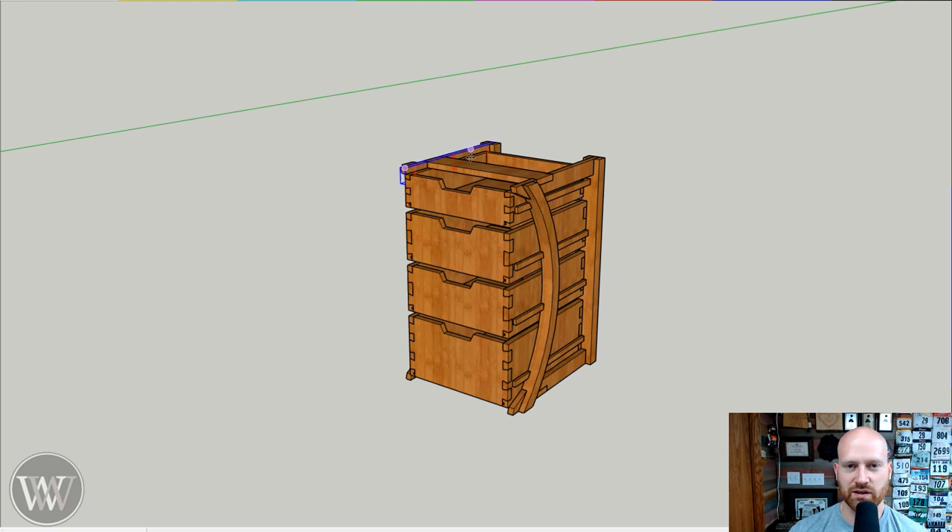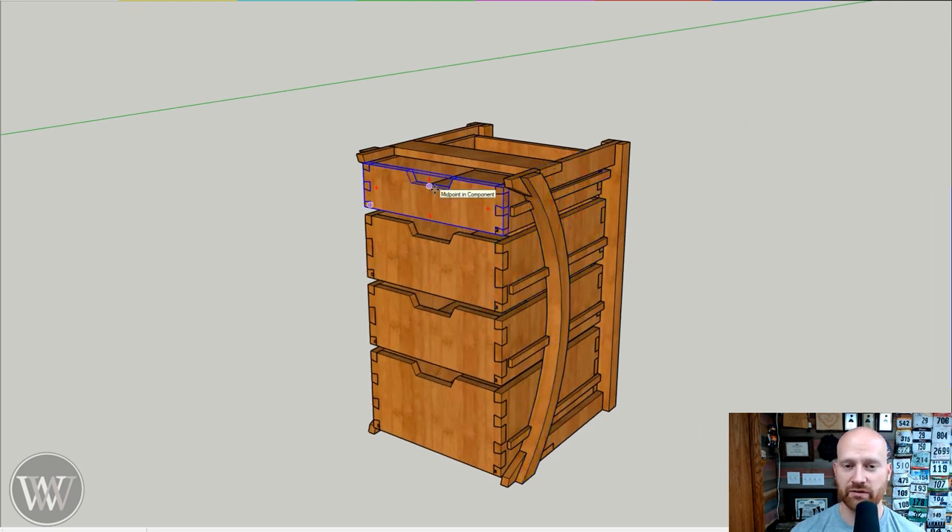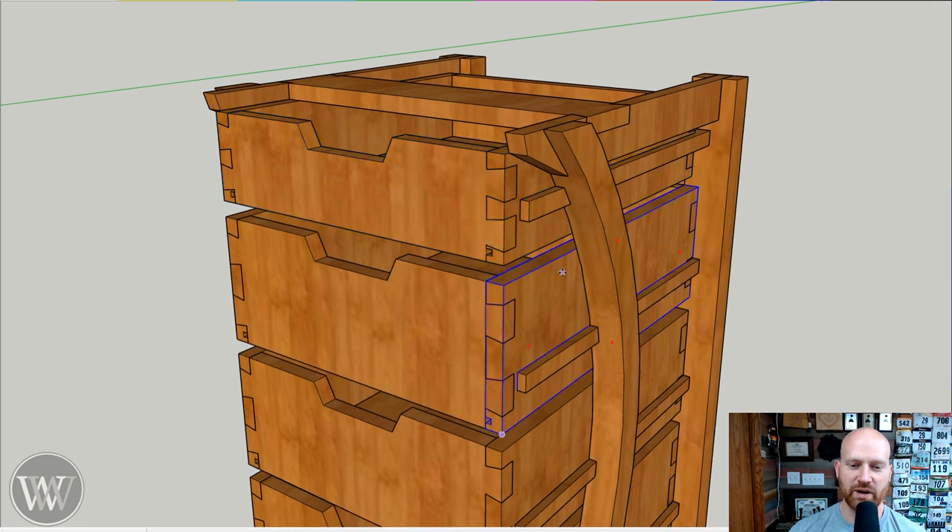A little closer look at the desk drawers themselves. This is just the rough sketch of it — I'm still working on the plans and the plans will be available when the project is done. Rather than having this geometric shape for the handle, I'm probably going to make it rounded to match the curvature of these. I want to keep that idea, but this is just the rough holder. I know I'll have a lot of questions about the dovetails being backwards. These are called show tails and they're on this way because I want to show the tails. Is that going to make them weaker? Technically maybe a little bit, but functionally no. I've actually done this for quite a few other things and they've held up perfectly over the years. If you really want to, you can put in pins — I'll probably do that as a detail, putting in a brass pin through the middle pin into the drawer, which will give you the mechanical advantage. Also, here you can see the open groove that will be closed, but for the sake of the sketch it's just quicker to draw that in.